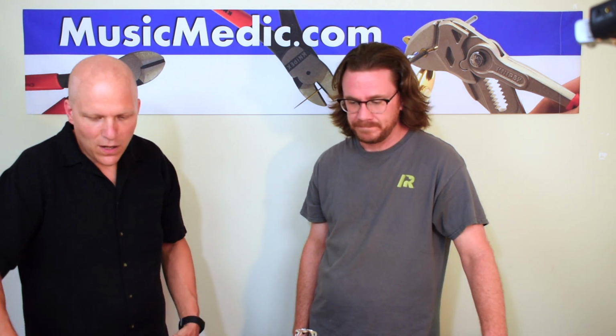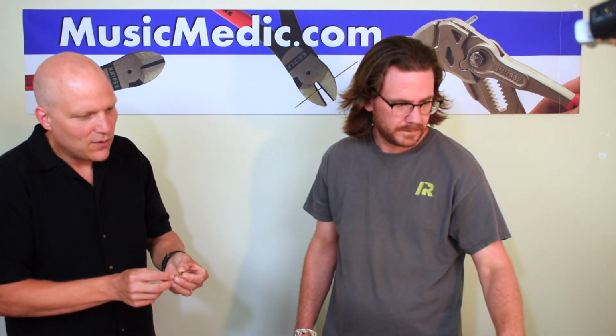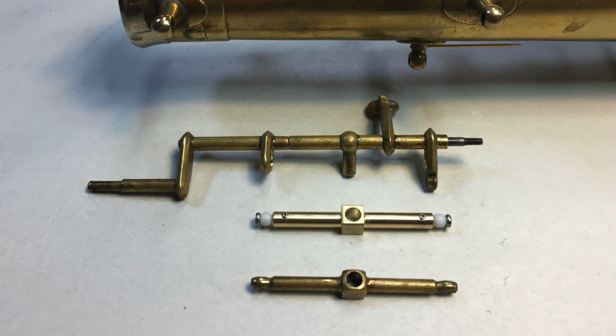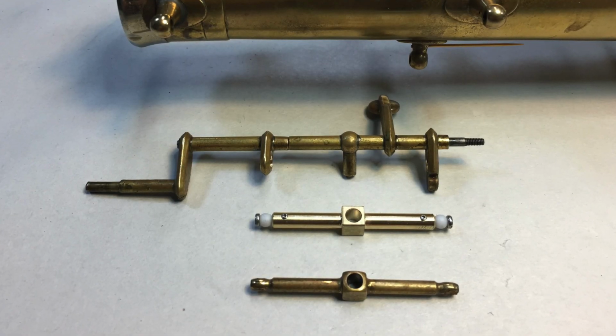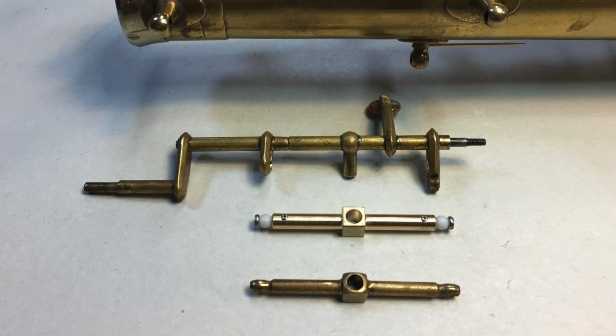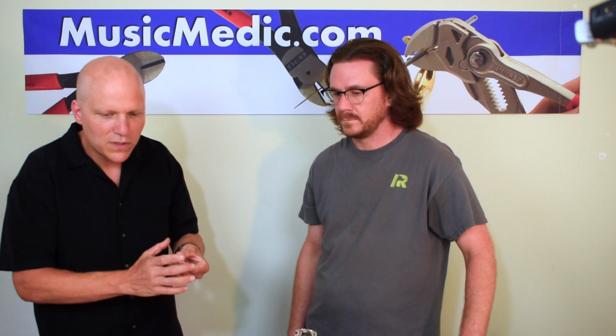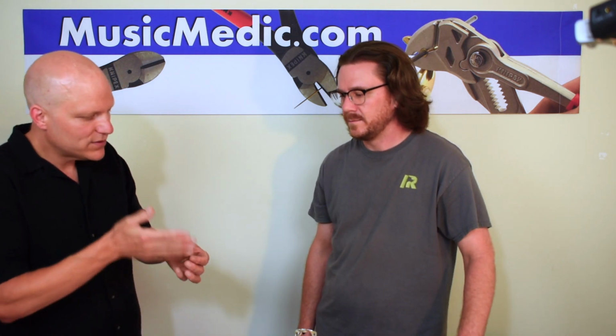The Teflon ball Octave Rocker has a lot of great things about it. By using an expanding Teflon ball, it takes out the play between the dog bone tilting mechanism and the rocker, which removes at least two of the wear or play points in there. That connects the player to the horn more readily when they push that button.